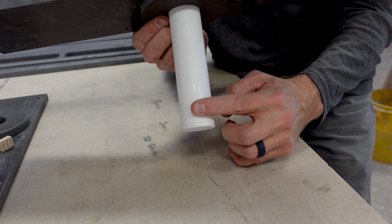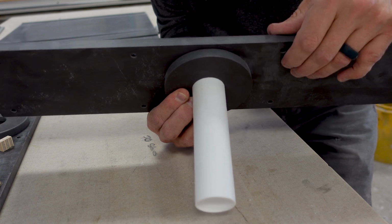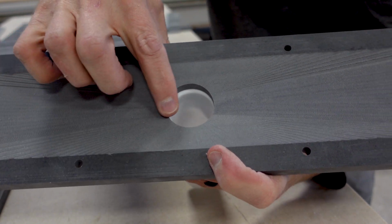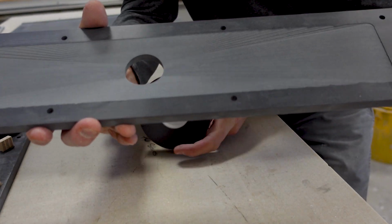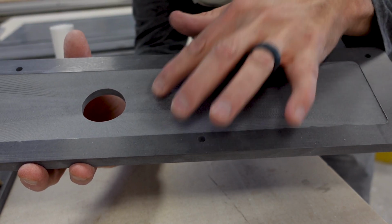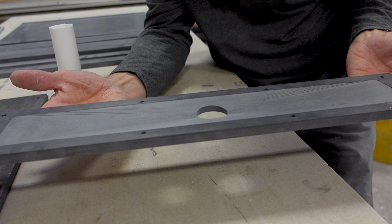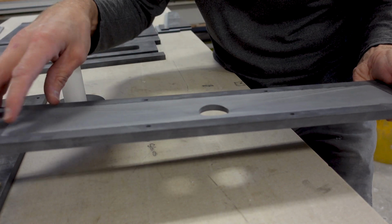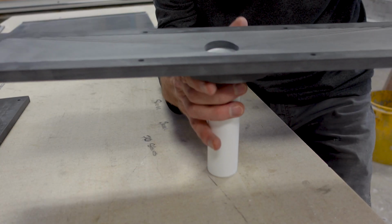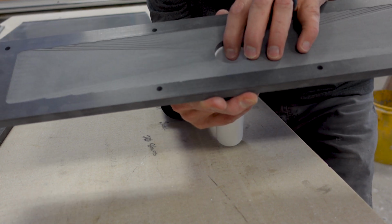You follow along? So this is the drain pipe that sticks out of the bottom. This is a flange that goes around there, so we can glue this onto the bottom and create a watertight seal inside of the hole there, so the water is going to go down there. And this bottom plate that goes onto the bottom of the sink, you can see that it's all been routed, the slope 1/4 inch per foot, so that when it's sitting like that, nice and level, the water will filter down through this little slot in the back of the drain, and it will drain down to this tailpipe. And that's it. That's all there is to it. It's a little bit time consuming cutting this.